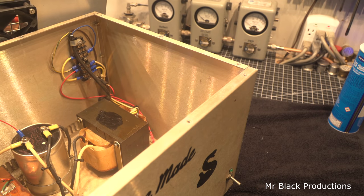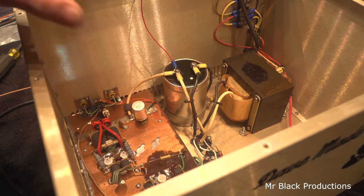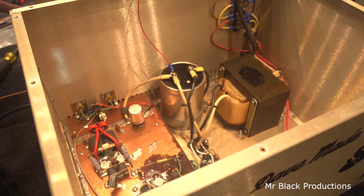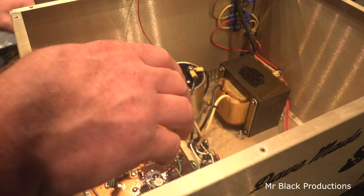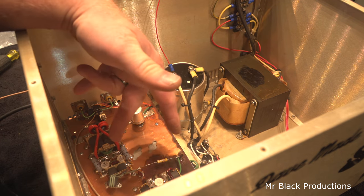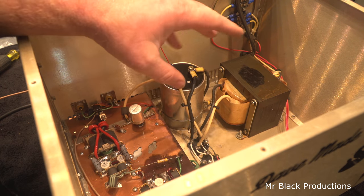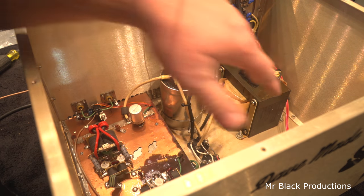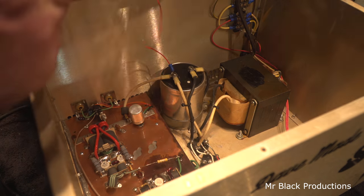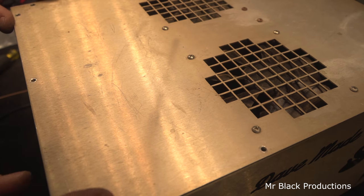Like I said, we cleaned all this up. Got all the oil off the board, cleaned up all the corroded bolts and shit that were over here in a corner, got all this to stop corroding, and then we washed it with acetone to clean the board up and get all the flux off it before we went and rebuilt the two pill section. So now all we did was shoot a little thin layer of clear on this and all of our other connections, including our transformer, which we washed off as well. And that'll seal the metal and keep it from getting icky gross again and oxidizing away.